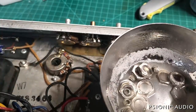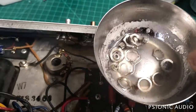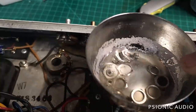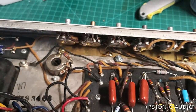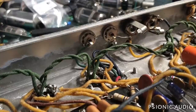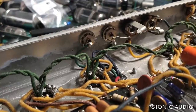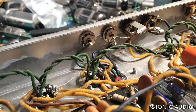I don't want that panel flapping around while I fight the lamp holder, so I've got all these nuts along with the set screws and board nuts from a '69 Laney soaking in WD-40 for a bit. I'm waiting for the WD-40 to loosen up that front lamp holder, so I'll go ahead and get started on the rear quarter-inch jacks — changing them back to RCAs while that does its thing. Hopefully this camera position will let everyone see what I'm doing without being in my way. The easy one is the vibrato jack.